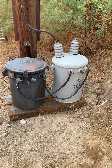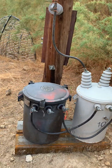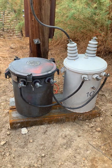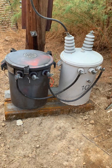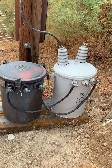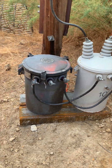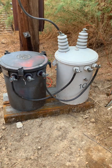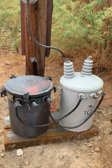In this video I'm going to show how I get power to my trailer. I've got 480 volts coming in right here. The reason I have two transformers is the one I'm using to step up to 7,200 volts has a 240-volt input. So I'm having to use this other transformer to step the 480 down to 240, and then back-feed the little 10 kVA transformer and step it up to 7,200.